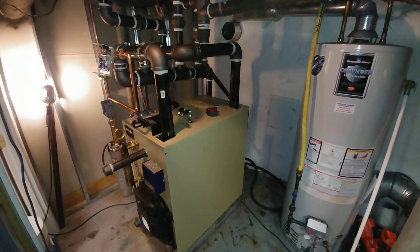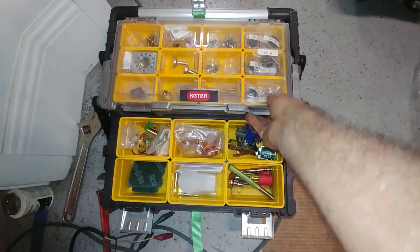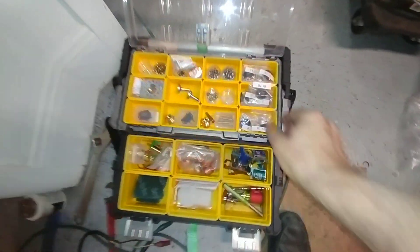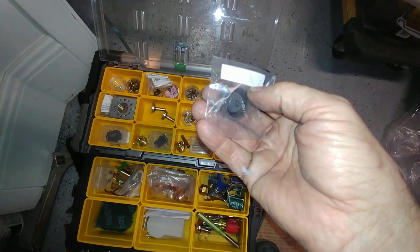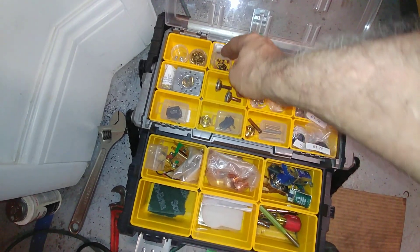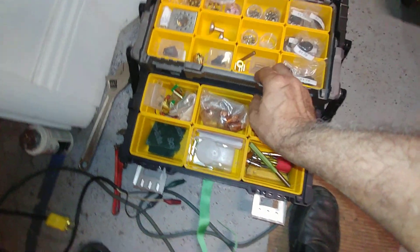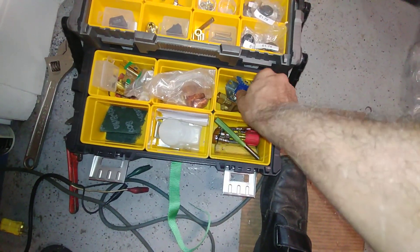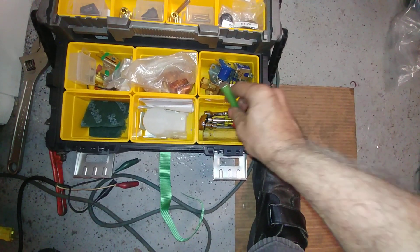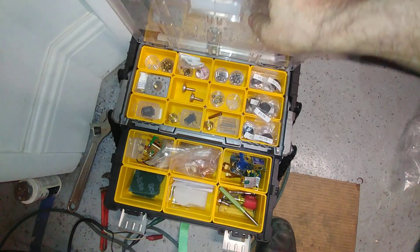One other thing - this is my Hydro-Level VXT valve safety first aid kit. You've got your internal diaphragm, spring and plunger kit, extra screws and washers, back O-rings, brackets, caps, extra switches, extra springs, adapters, solenoid valves of various varieties, an extra valve cover if you want remote operation, and specialty tools for working on this valve. I think all in all this should get me out of most trouble I'd ever have dealing with these valves.